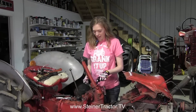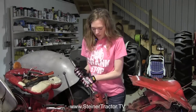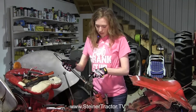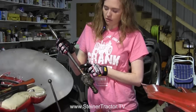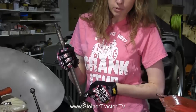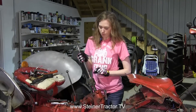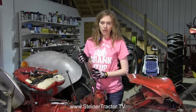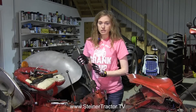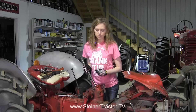Now I want to show you the inside of the steering box. I have these four bolts removed so that this can pull off. If you elect to replace your steering gearbox completely, you wouldn't need to take that apart unless you're just curious. Here you can see that the bearing is warped and worn, and you can also see that there have been some repairs to the shaft. Obviously somebody tried to fix this and when they fixed it maybe they didn't get the shaft completely straight, which would cause the bearing to get worn — not a correct and proper repair. It's definitely easier and a better fix if you just replace the steering gearbox completely. You won't have issues later on down the road if you just replace it.